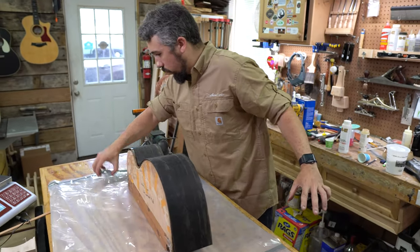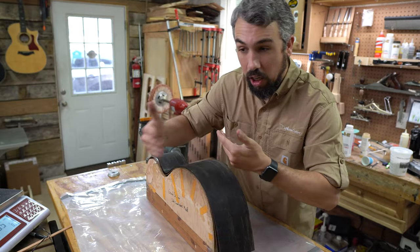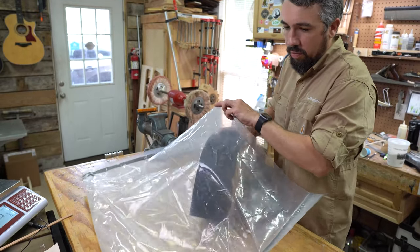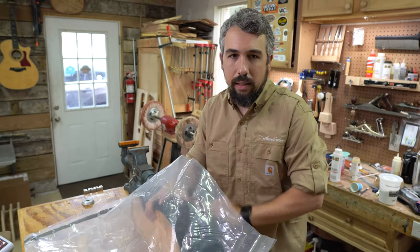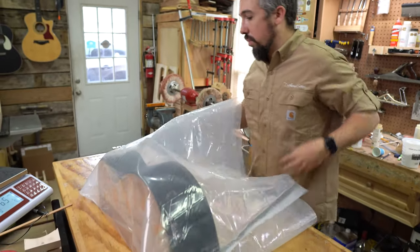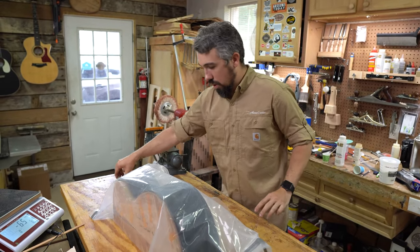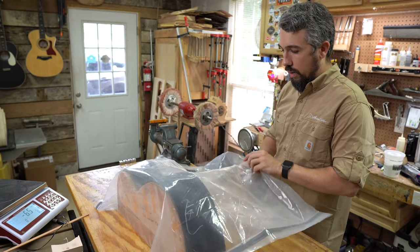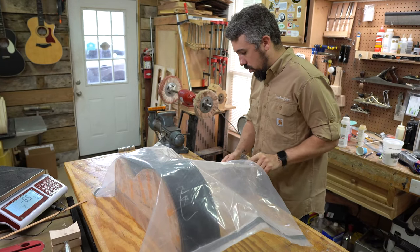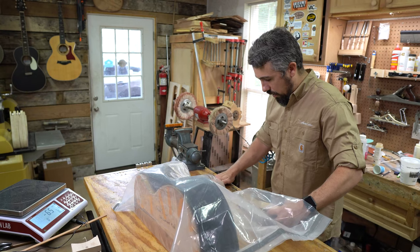We're going to set the pieces together and make sure they're lined up so they're not misaligned. Then we're going to carefully get this inside the vacuum bag — I'm going to lift the mold rather than slide it in, because this mold is pretty heavy and I don't want to get any holes in the bag. The last thing I need to do is make sure the vacuum coupler is on the inside, and then I'll apply that last piece of tape on the leading edge. We'll be ready to seal this up.